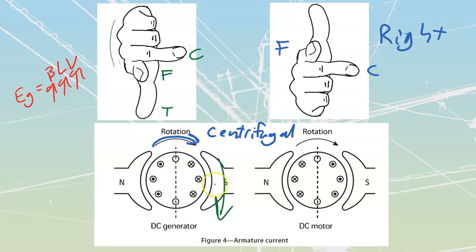If I take a look at this and I use my left-hand rule, stick your thumb in the direction of current flow, stick your fingers around, you're going to see that this is going to rotate now in a counterclockwise manner. Once I see it rotating in a counterclockwise manner, I'm going to be able to see how it is going to interact with my norths and my souths. So these are my direction, my field rotating around here. Just make that a really clear arrowhead.